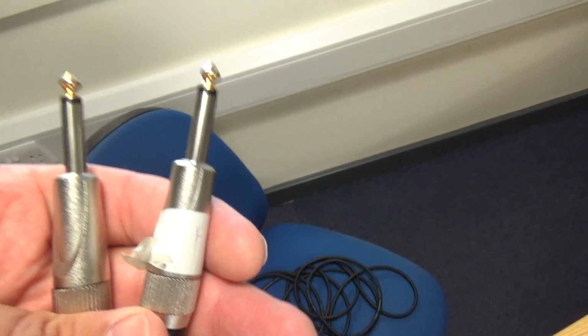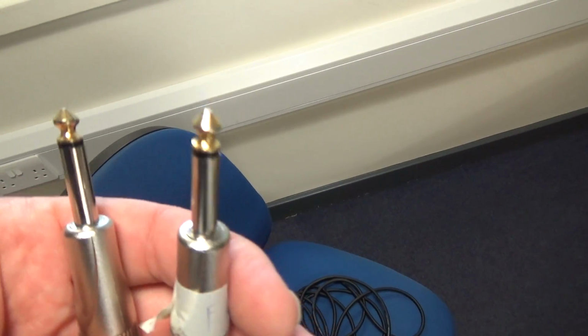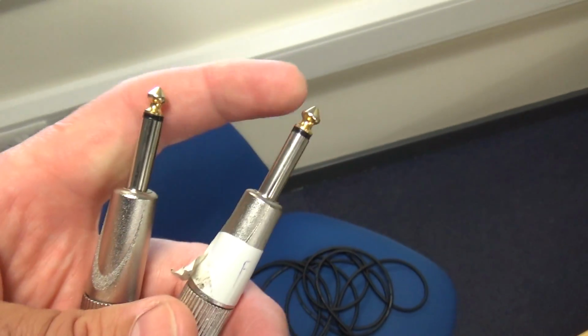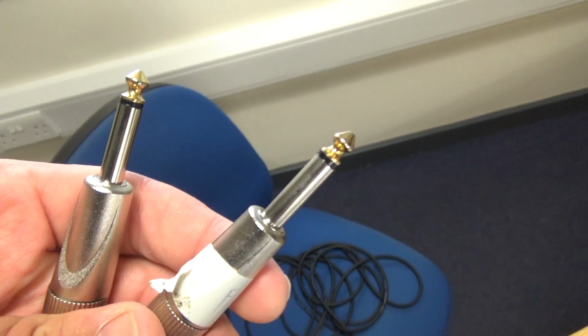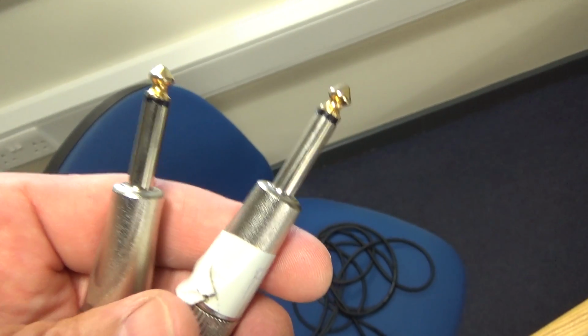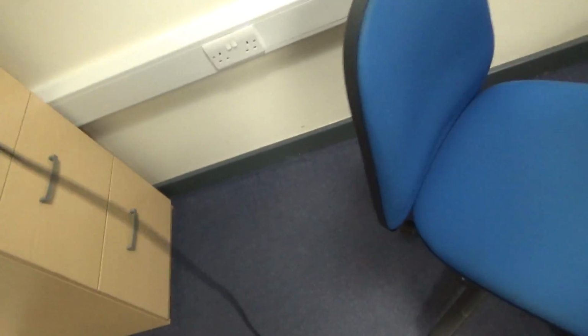Okay, this is unbalanced. This cable does not do any clever phase trickery on the cable run. It has 2 connectors, the tip and the sleeve, and if this cable picks up noise from a phone or radio interference, then that noise will remain on the signal. So that is the downside of the TS jack cable. The TS jack cable should probably be, I can't really fold it up properly at the moment, but the TS jack cable would go on the bottom of these.